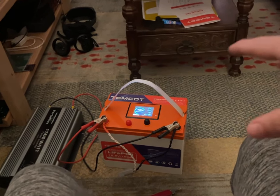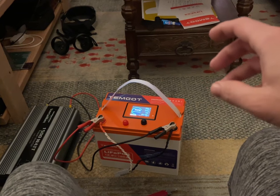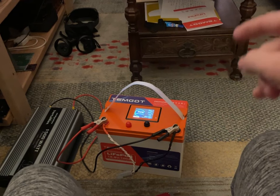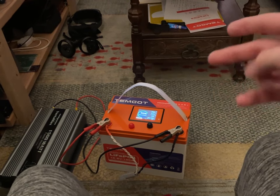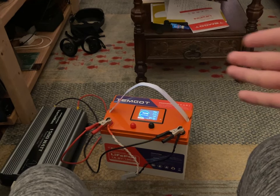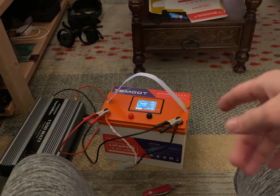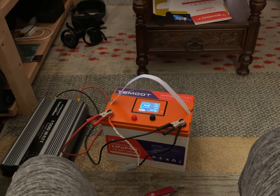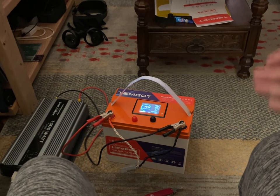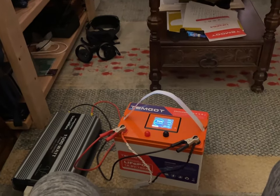And so I want to, you know, this battery pack would be too small for a big panel system like what I could make at the workshop. But this would be perfect for our apartment because I have a 30 watt panel, I have a 15 watt panel, that's 45 watts. That could be maybe 250 watt hours a day on a good day. And that could fill this maybe a quarter if we're lucky. And if we could run things like lights, or even just the entertainment system, well, that's pretty good.